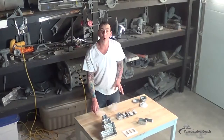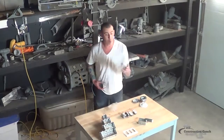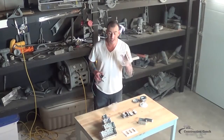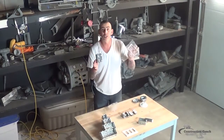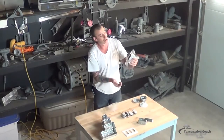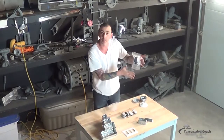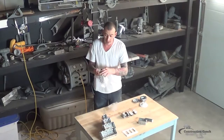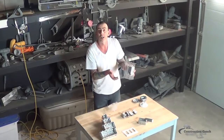Just a quick note: whenever you are using an electrical box on an exterior wall, it is very important that you use a polypan — or purchase the selected size polypan for each of your devices. This polypan here is for a single device box. You fit it inside and attach it to your stud on the side. Then, when they tie the rest of the vapor barrier in, they have these flaps to tie on and the vapor barrier is technically unbroken.